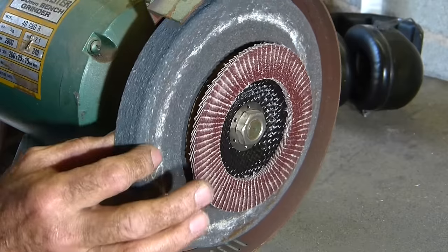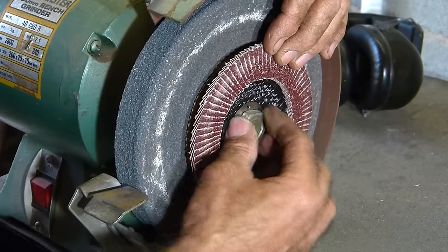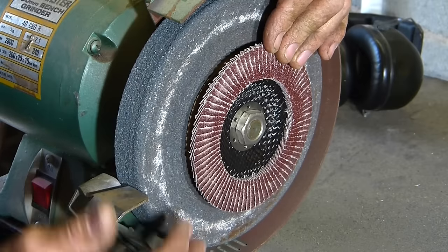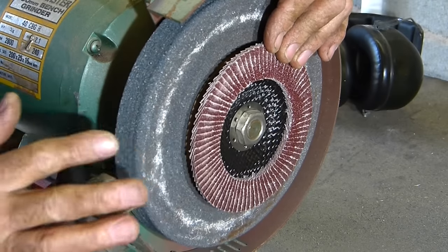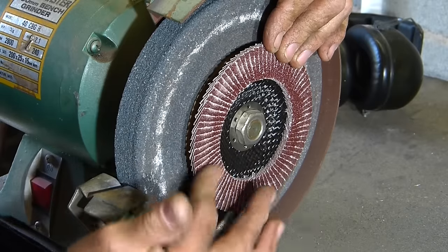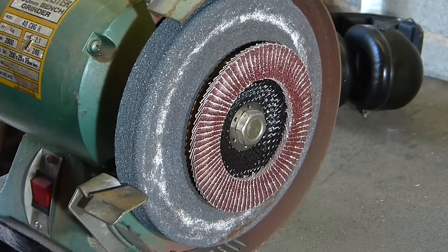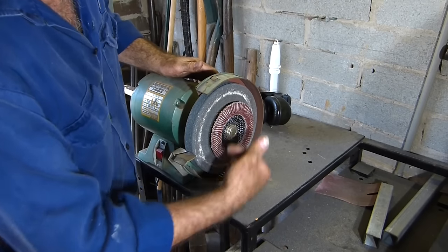What I've got here is an 8-inch grinding wheel and a flap sander, bolted to the inside edge with the same bolt. The flap sander runs nice and quiet when it's on here, so it's good — just grind a bit of metal and touch it up on here. You can only put the flap sander on this end of the grinder because it needs to rotate in this direction.